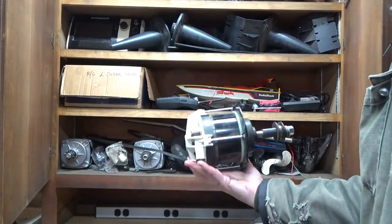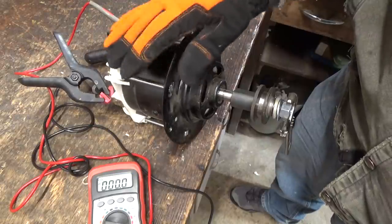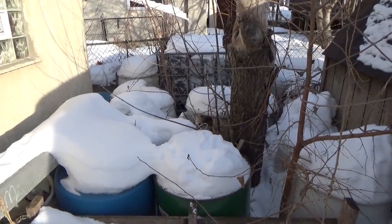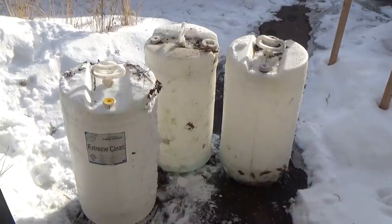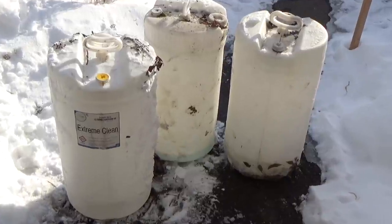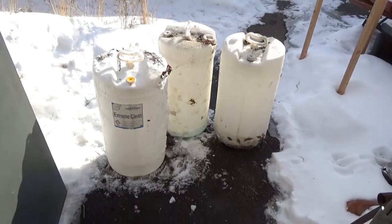I also have this 36 volt motor from a mower. I can get almost three volts out of this lawn mower motor just by cranking it over by hand, so this should be a good contender for our wind generator. For this style turbine we need something more like cups than blades, so I have to find something I can make into curved cups. I do still have quite a few plastic water barrels - pretty frozen in at this point of the year. I was able to dig out some of these 15 gallon models. I could use the full 50s or even 30s but then I'd have trouble transporting this rig in my car. These used to have soap in them so once we cut them open we'll have to get that frozen soap out of there and dispose of it.